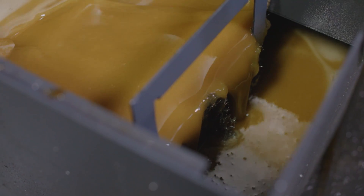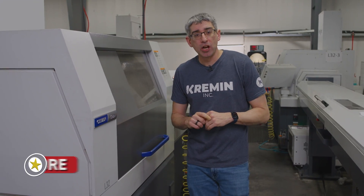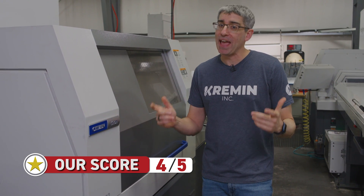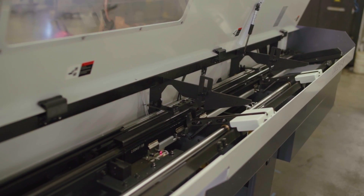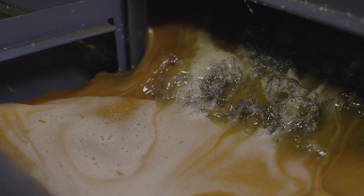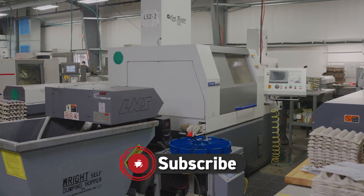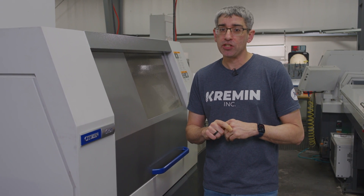Maintenance of this system is really important for lights out operation. All in all, I'd give this machine a four out of five stars. It's a fantastic production machine for us but it has some minor quirks you need to be aware of. Be sure to check on large diameter stock if it's gonna run through for you. Be sure to manage your chip flow and make sure that's taken care of so it can keep running on those unattended operations. I'll take you through the rest of our Swiss lathes in future videos — be sure to like and subscribe, and put a comment in if you've got questions.